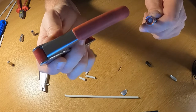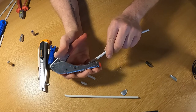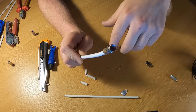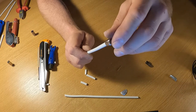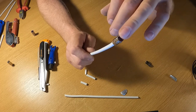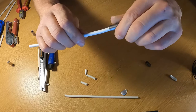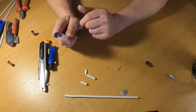The crimping tool is exclusive to this brand of connector. It goes on underneath and crimps it down - that's a compression fit. This is the prime way of doing it. These connectors aren't cheap - each one is probably ten times the price of the push-on ones, so you don't want to lose them. But they are not coming off - you could pull that to your heart's content.